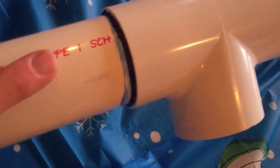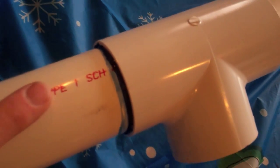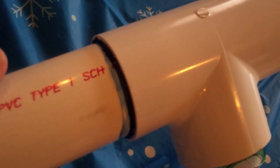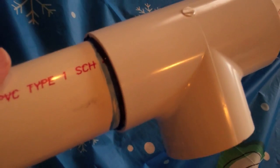Let's put it together. We're going to go ahead and put some glue inside the pipe that will be sliding into the T-joint sleeve. It goes inside the sleeve and on the outside of the pipe going into the T-joint. After you put it on the outside of the pipe, you just squeeze those together. The glue does dry pretty quick, so we're going to go all the way around and do all the joints.